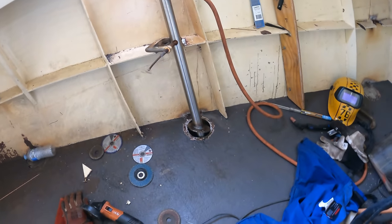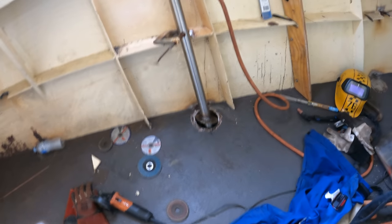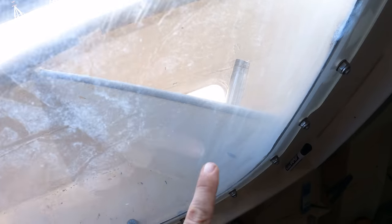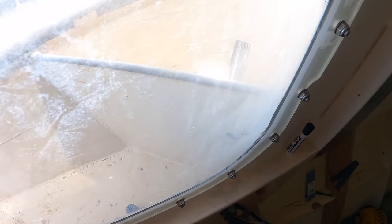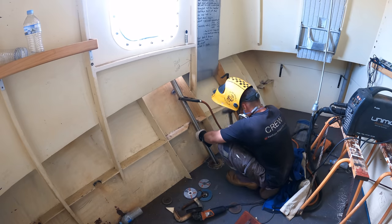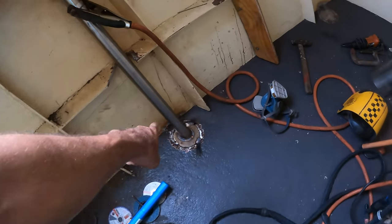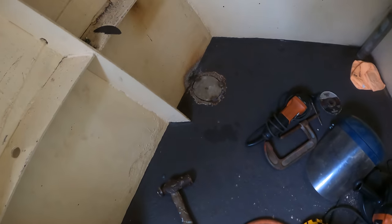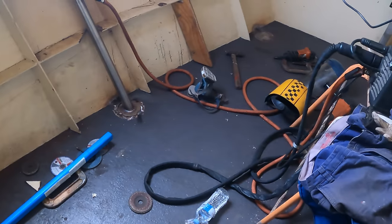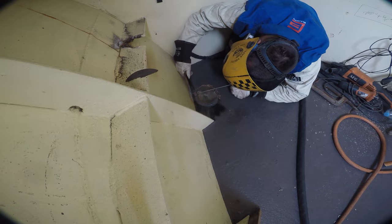So we'll spin this pipe around and get that mounted, and then that allows us on the outside of the boat, just in front of this little piece you can see going across there, that's a washboard to direct all of the wash from the bow over the scupper, but we've got the pipe you can sort of see sticking randomly out the front there. We need to mount that. We've welded the pipe onto the plate, but we haven't welded the plate into the tank, and then also that one at that end is all tacked in. Today's job is go through and weld everything in.